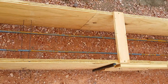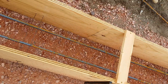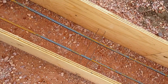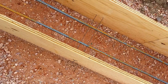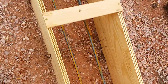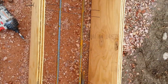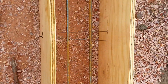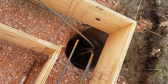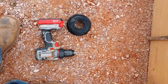I told you I'd show you how you can make your concrete forms ready to hold concrete for six bucks, or four bucks depending on where you live. Basically I'm just using baling wire, tie wire, tying the forms together about every 18 to 24 inches, kind of wherever I need it, reinforcing the corner. That's all I'm using — just a roll of baling wire.